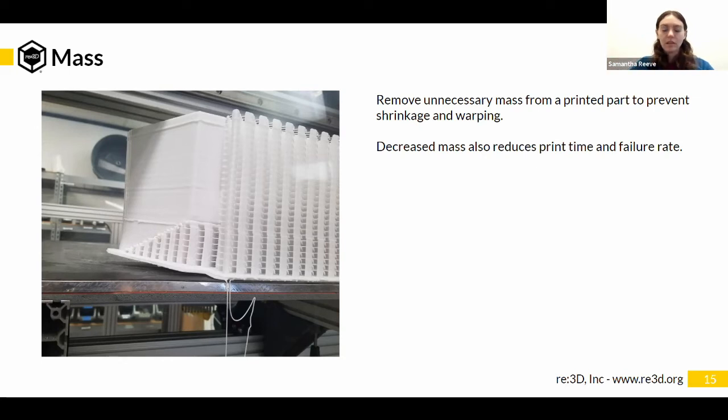A thin structure can shrink in place and it's fine. So things to think about when printing: avoid extra mass, especially for high-temperature materials or parts very prone to warping. Things prone to warping are big flat pieces and very dense pieces because of all that extra mass. Even if you're using a material that almost never warps, it may still warp if you have a very flat, high-density part. Every material and every geometry has a chance to warp — some more likely than others.